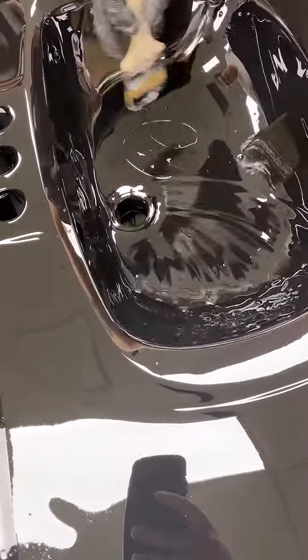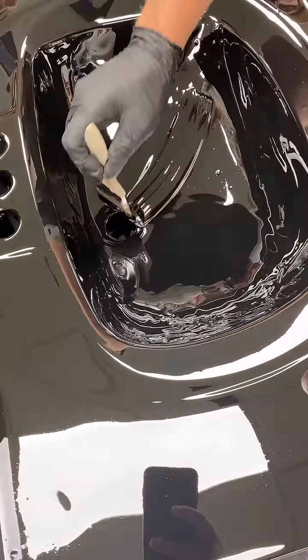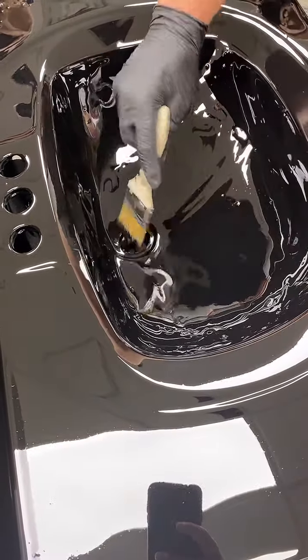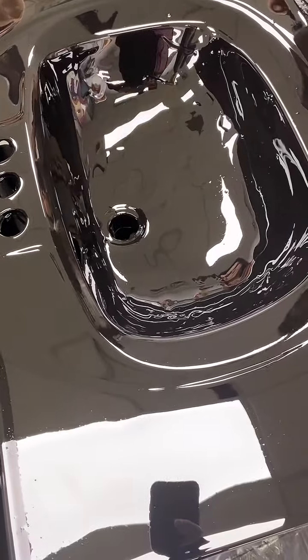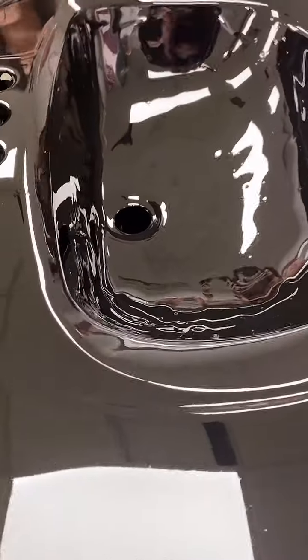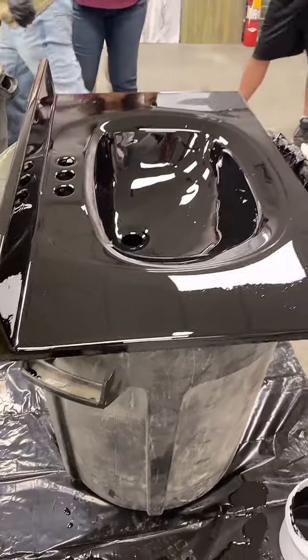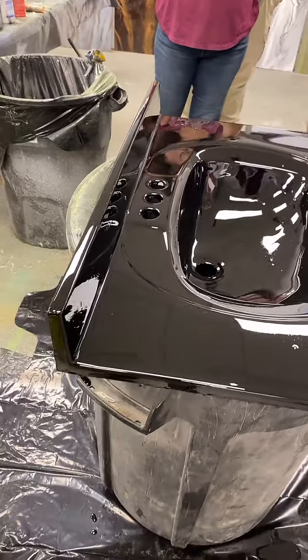If this was a tub, we'd be capping the drain off sometimes, and sometimes you can remove the drain as well. But if I remove the drain, I just use foil tape kind of like a pipe shape around the top — you can make that shape with foil tape. You really have to make sure it's well bonded too. Then the next morning, just pop it off.